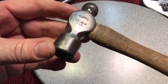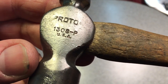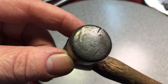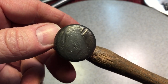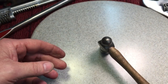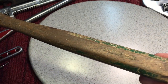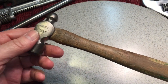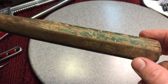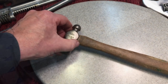Okay, here's our post wire brush evaluation. You can see the model number is Proto 1308-P. And you can see here what I was talking about — the damage in the face. I don't know what they hit with this, but they hit something hard. These lightweights are made for tapping and small duty — the 08 might be eight ounce. That long handle gives you a lot of swing leverage, so you've got to be careful. But now we're going to cut off the bottom — remember what that looks like. We'll cut off the bottom, scrape down the handle, see what we can do with the head, and then we'll tighten it up a little bit.